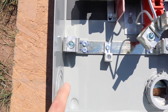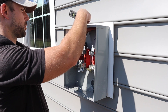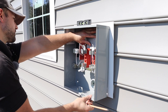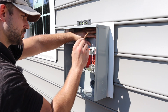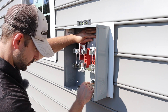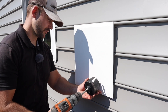I'm going to install this base with lags, and I've got to knock out each corner that has the indention for the lags. I'll set my meter up about where it goes, put a torpedo level on top and set it nice and level. Then double-check to make sure I'm centering my J-block — I installed this while I installed my vinyl siding. Take a pencil and mark the holes where the bolts are going to go, then mark the hole for where the SEU cable is going to be going through. I'm using a three-inch bit because that clamp on the back needs that room.